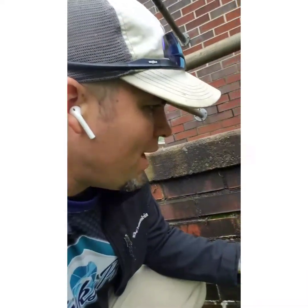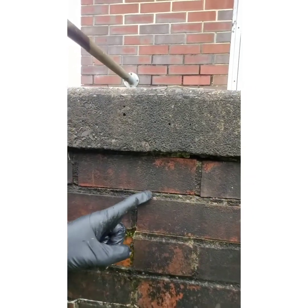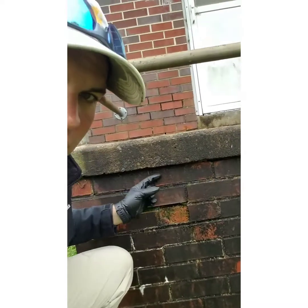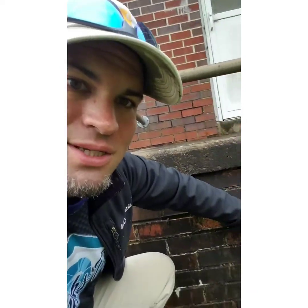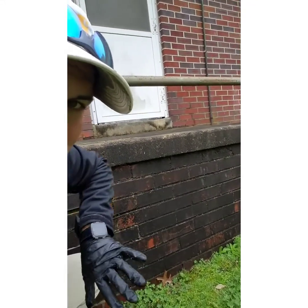So this is where it's crazy super important to not blast this with high pressure. You see how it's kind of crumbly right there? So Johnny that has a pressure washer with a 4,000 PSI machine, two and a half gallons a minute, is going to come out here and scar this brick up trying to get all of this growth off. Now what I can do with my machinery and my chemicals is I can actually deaden this — I can actually kill this stuff where it stands.